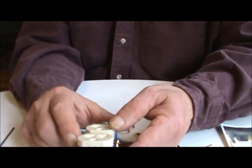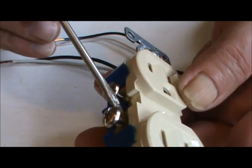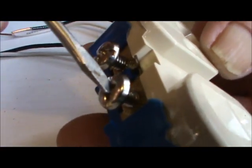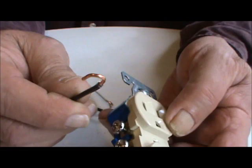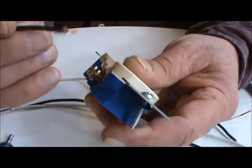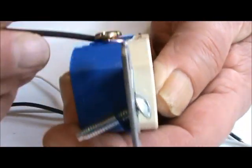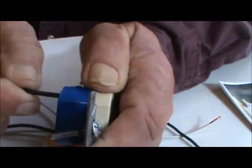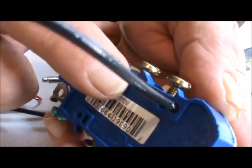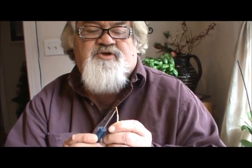There's several reasons for that. If you see right here, that little piece of wire — that is the only thing carrying all the current from this to this. So if you've got a wire this size, 14 gauge, and if you wrap that around your screw, that's going to make a nice tight fit. But if you happen to stab it — which is an old timey way, you just stick them in like this — all you got in there is a little pincher that's pinching it. Your wire is in there and this little piece of metal spring-loaded is just touching it, so all your current is traveling through that.